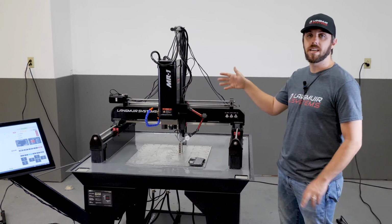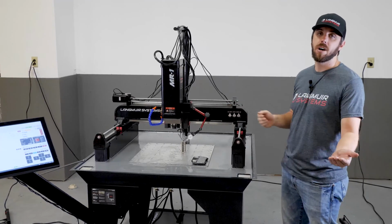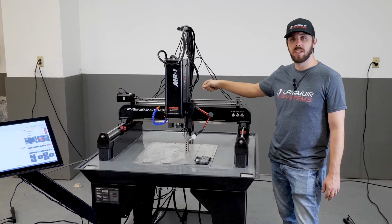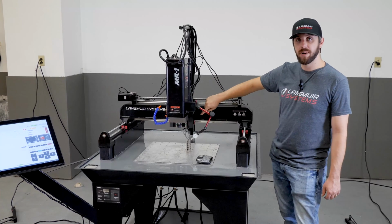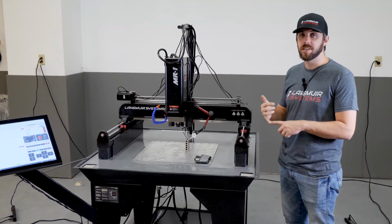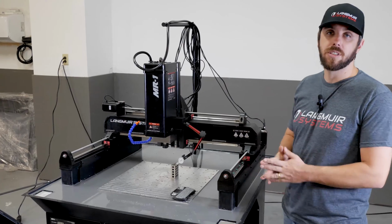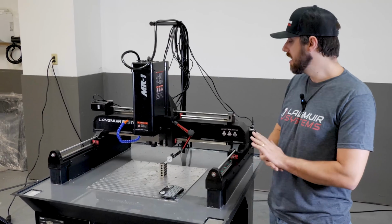So in this video, we're going to be checking the z-axis alignment perpendicularity relative to the xy plane. You'll recall previously in the assembly process, you were required to determine the number of shims that would need to be installed either between the upper bearings and the x-axis carriage or between the lower bearings and the x-axis carriage. That was dependent on the information provided on the inspection tags, which were applied to the gantry and to the x-axis carriage. The point of that was to get as close as possible to provide basically a starting point of shims needed to ensure really good z-axis alignment.